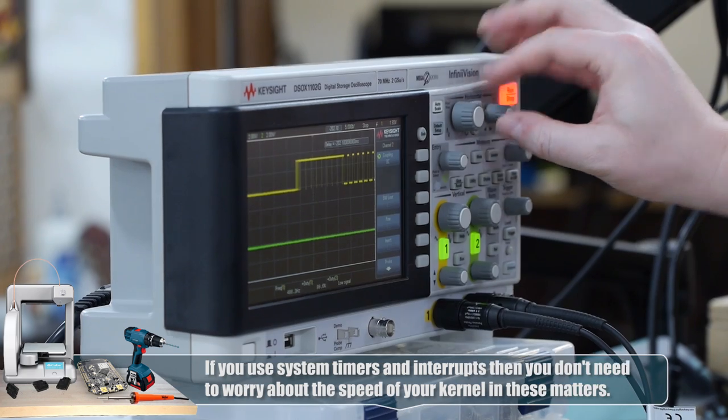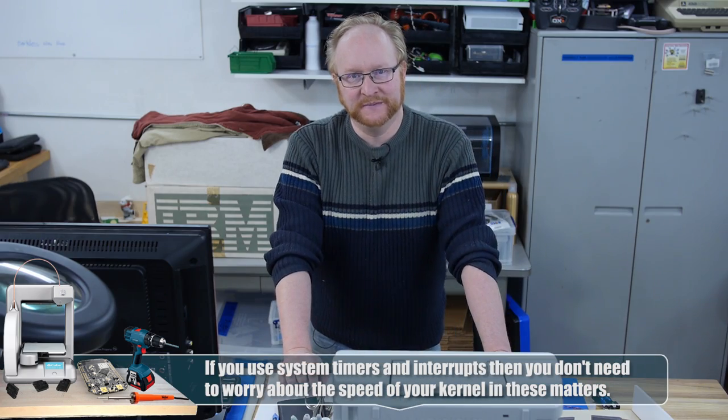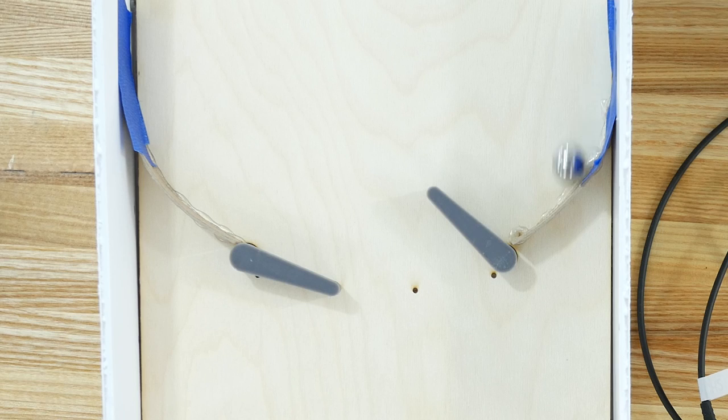All right, so we have to get the high pulse signal wider in order for the flipper to make it all the way up. We'll find out whatever the minimum distance is to make the flipper go up, and then we'll double it. And then that's what we'll use. At 2,000 kernel cycles, it looks like the flippers have enough power. But what if they don't?